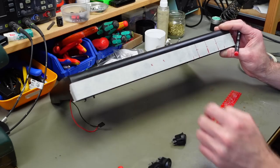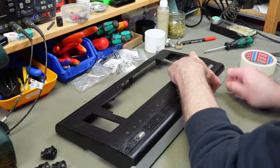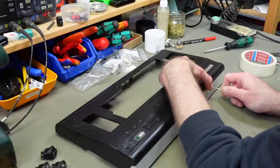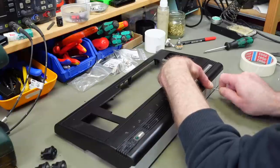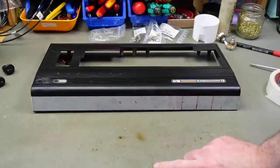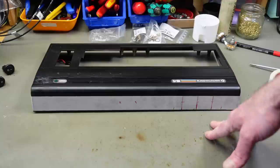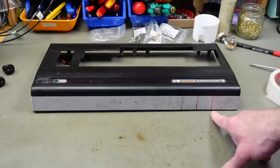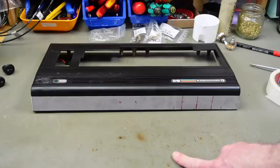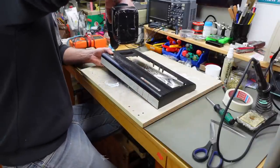these things, potentiometers. So let's mark the positions here carefully to not risk damaging the plastics. So that's our drill positions: switches, audio jacks, potentiometers on top here. I'm using a steel drill bit. I'm using a small one, I think a 4 millimeter drill bit to do the pilot drilling. And then we're going to see which diameter we actually need and use a step drill to widen the holes. I think I want to start with these because they are the most notorious ones.